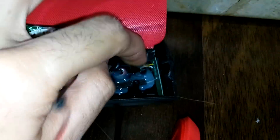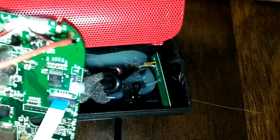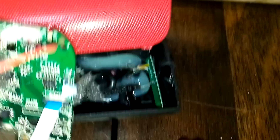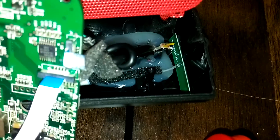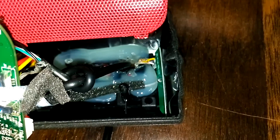You open it up — there are plenty of screws that you've got to unscrew and finally get it open. Once you do that, you'll notice the section where they have these connectors has got some sort of white gooey substance. It's very difficult to remove the PCB on which the female micro USB connector is mounted. I had to pull it out with tweezers, applying a lot of pressure, and even use my soldering gun to melt a bit of that white substance. Finally it gave in and I got the PCB on which the connector was mounted, and I just snapped it out.